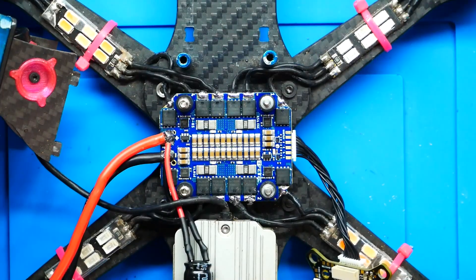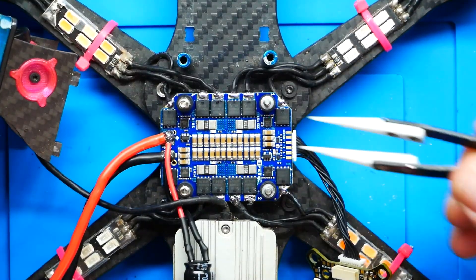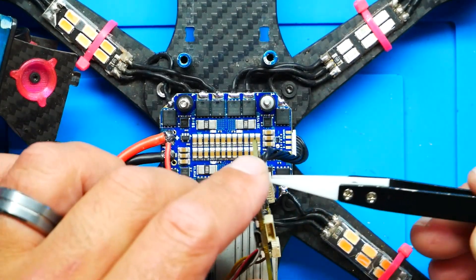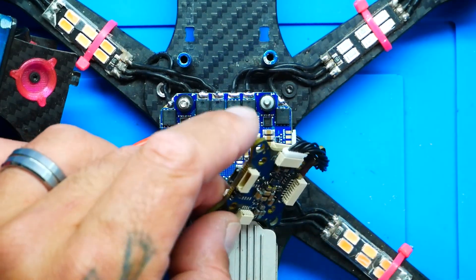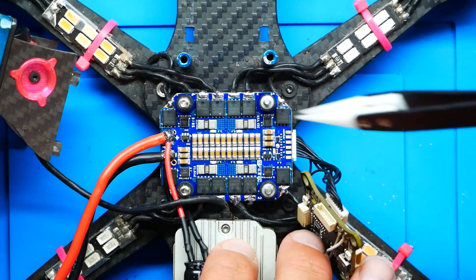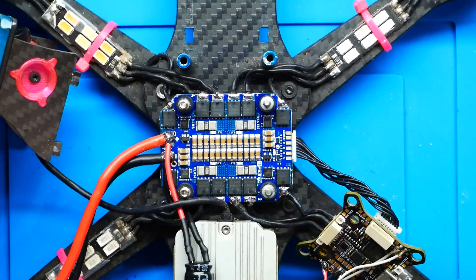Let's go ahead and drop this puppy in — 1, 2, 3, bam! All right pilots, I didn't want to waste your time with the boring details. We got the 65 amp ESC in and I've plugged in my flight controller — it was as simple as plugging in here and plugging in here. Just be mindful if you're using the G4: the G4 does support two ESCs, and you can use two 65 amp ESCs if you want to never blow one up. Just use the top plug to your first ESC, bottom plug to your second ESC, and you're on your way.